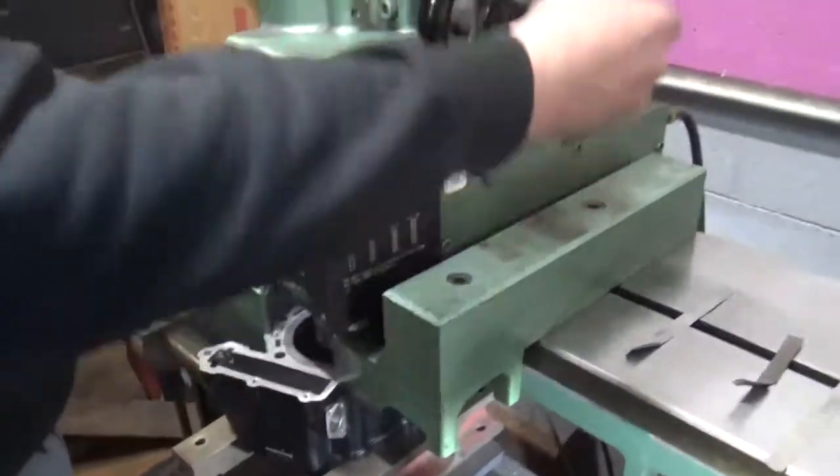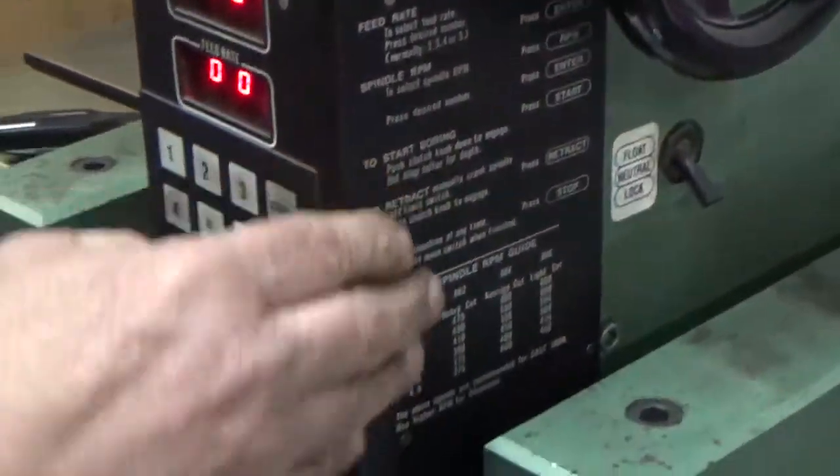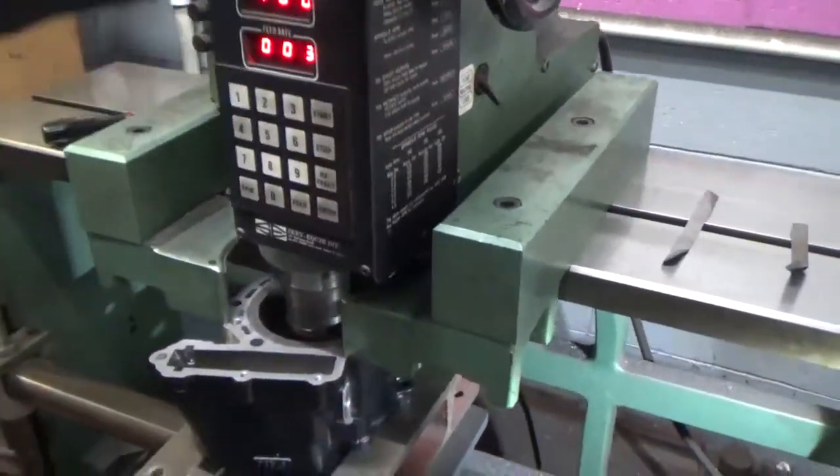This is kind of a good starting point. We've got some new tool bits here and these things seem to like speed so we'll go ahead and get started. We're going to go a little bit slow because we've got the ridge up here from the ring turnaround — we'll start slow and see how it feels and then we can always speed up or slow down as the case may be. So here we go, we're going to get ourselves down kind of close and go ahead and engage.